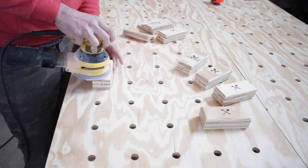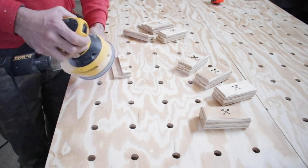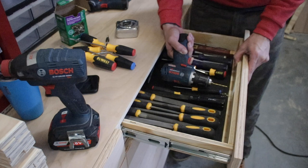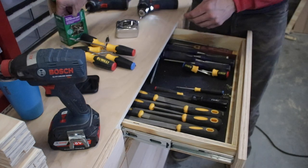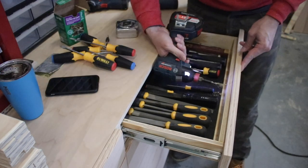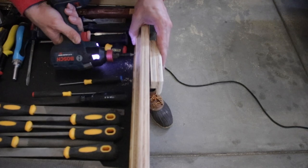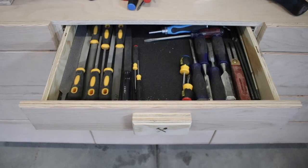After branding, it was the joy of sanding — fun for about five seconds and then I just had to settle in and knock them all out. For the top drawers, it was easy to install the drawer pulls because I already had holes in the drawers from when they were previously attached. I just drilled through those holes through the front plate so I knew exactly where they'd be, then piloted some screws through and matched up the drawer pull to lock it in place.